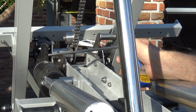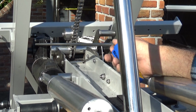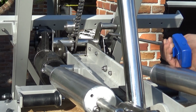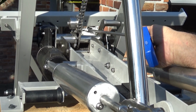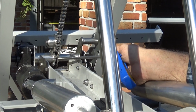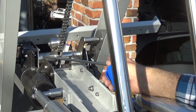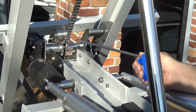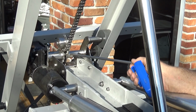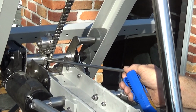I've had to pull the gearbox apart and drill or bore a hole completely through it, so that I've got a wheel on the outside and another wheel here, and there's an actual axle that goes right through it. To get a reasonable drive of the chain over the driving sprocket, which is this one here, it's driven by a key through the output of the motor. I've actually put 2 gears on here to give the chain good contact with that particular sprocket.